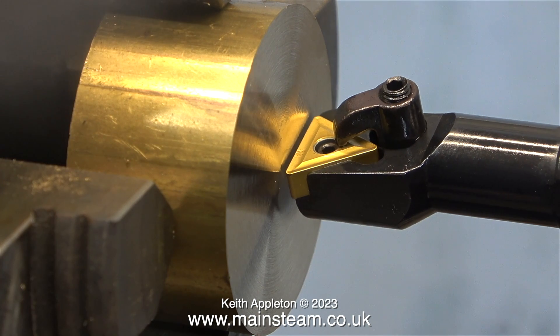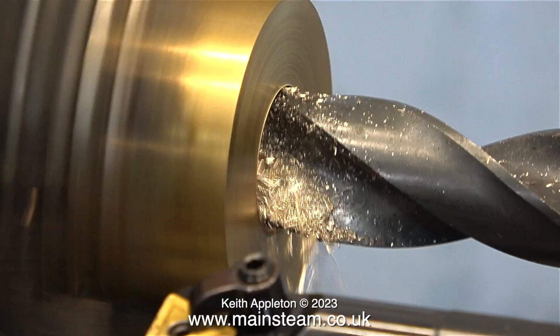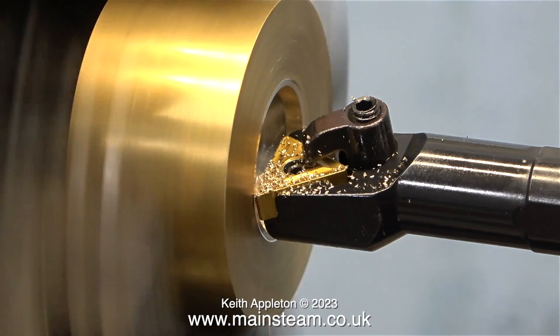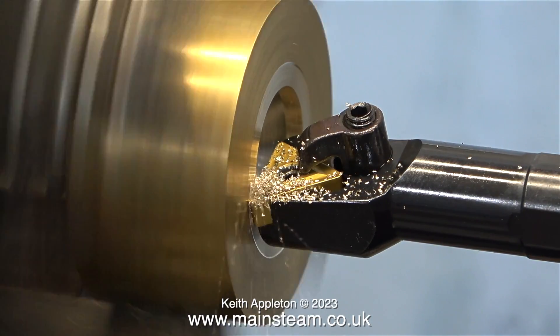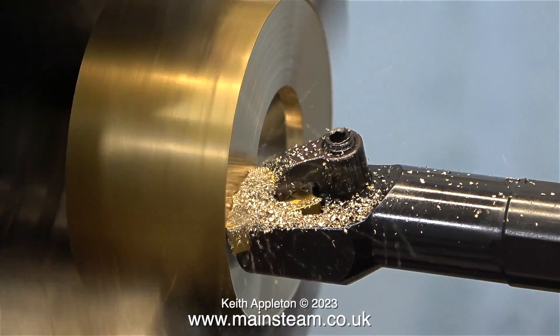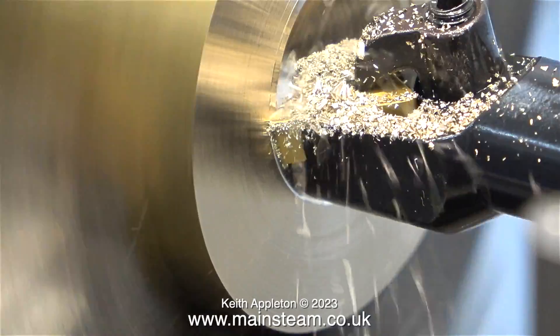Once again, there are different ways to obtain the centre height of a lathe tool, whether it's a boring bar or a normal lathe tool. As before, a centre in the chuck would be okay — you would just align the tip of the tool with the centre. I set the centre of the boring tool to the centre of the machine marks on the piece of brass I'd just turned with the other tool, so the tip is now set to the centre. Although this is a boring tool, at the moment I'm not using it as such — I bore a little way into the brass and then change the position of the traverse so it comes towards me. The feed is still a little bit high, but the finish is really good.